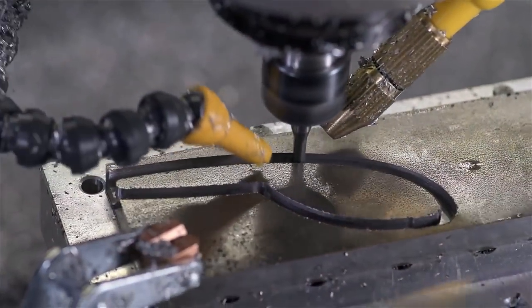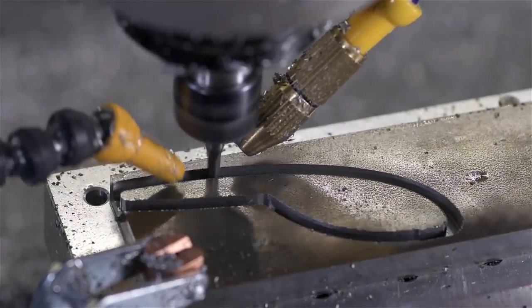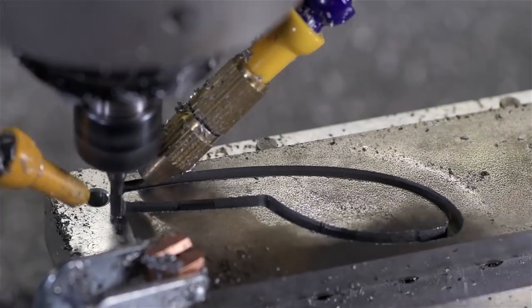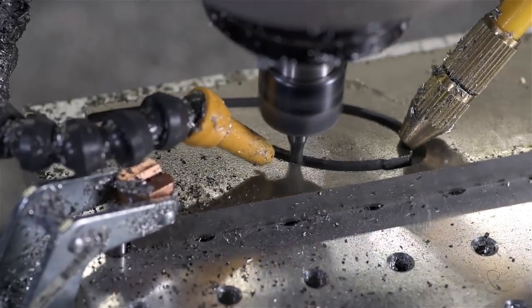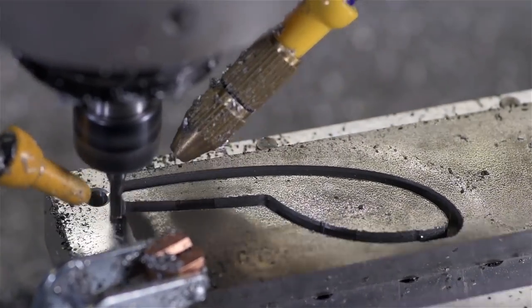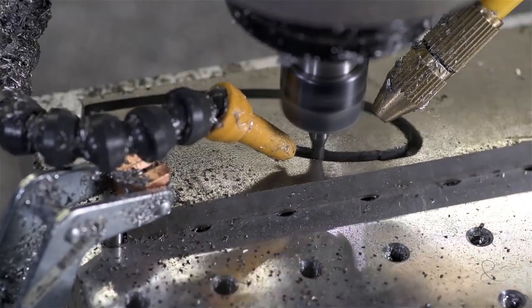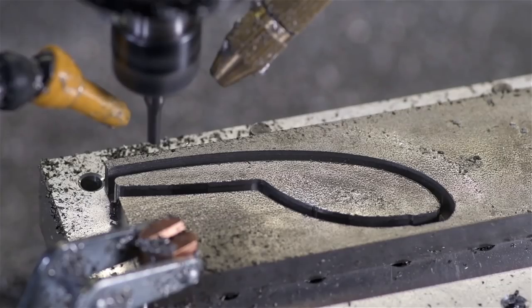This is cold rolled steel, 3/8 of an inch thick. Routing steel always makes me nervous, but frankly, I think I have less problems with steel than any other material, though maybe because I'm more cautious with it. That's a small four-flute carbide end mill, Chinese water torturing the stock, taking 60 thou depth of cut, about a millimeter and a half, at 12 inches per minute, 300 plus millimeters or so. Took about 6 passes to get through it.